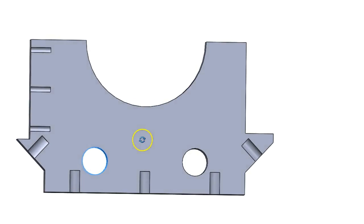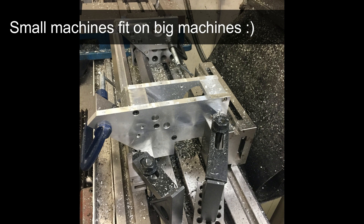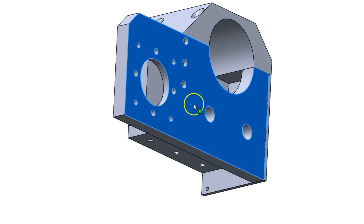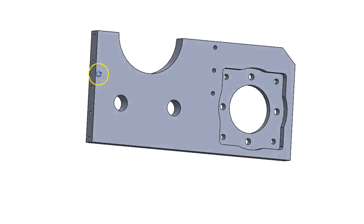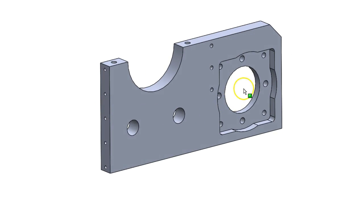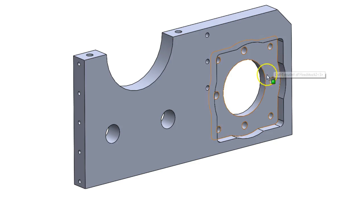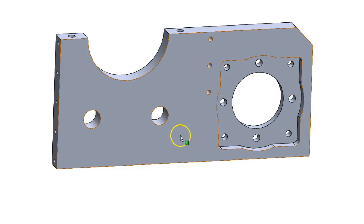These holes are for manual machining only really — I didn't need them in my assembly, but in my last lathe I used them as sort of built-in sine bars to keep everything aligned. These would be reamed half-inch holes and you could use those for alignment pins and things — it actually works really well. This is kind of a back plate, and this is my least favorite part of headstock assemblies because I still haven't got a go-to design I'm happy with yet. But this is more or less a component that locates the motor with respect to the spindle, and you can see I've got these sine bar things built in again.